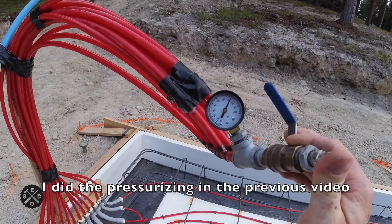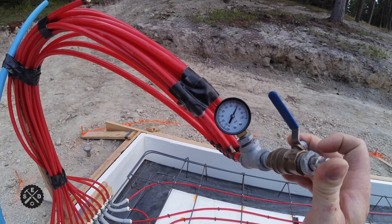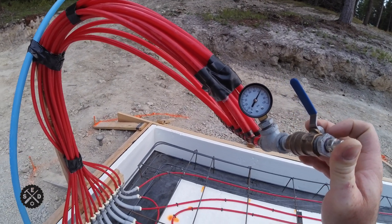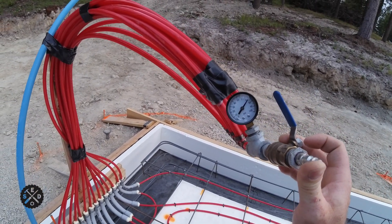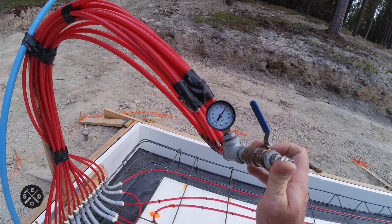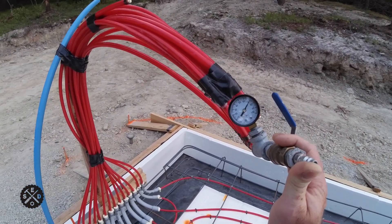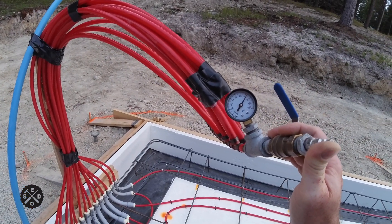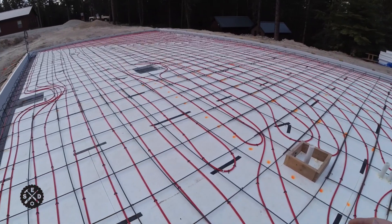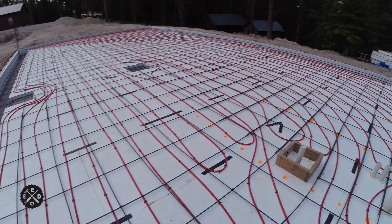The pressure gets down to about 72-73 psi during the night when it cools off, then gets back up to 75 when it's hot — I expected a little fluctuation since it's right in the sun. During the pour, the guy that designed my system recommended dropping it down to 30 psi. Once you've maintained 75 psi for at least 48 hours, drop it down to 30 — I'm probably going to shoot for 35 or 40. The reason is if you have a blowout, it doesn't blow concrete everywhere because there's a lot of pressure and air volume at 75 psi with this much PEX.